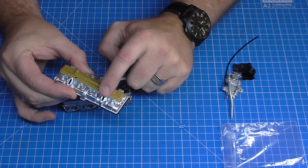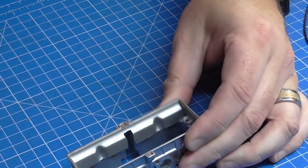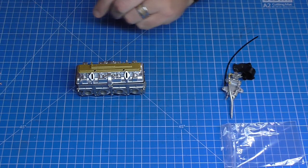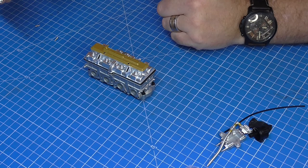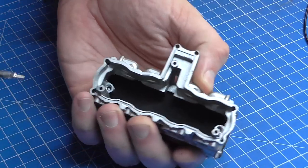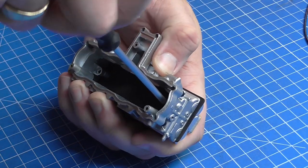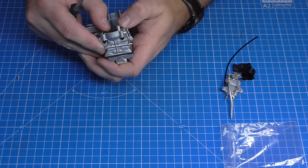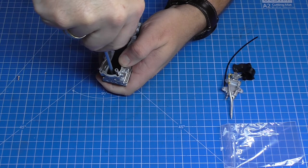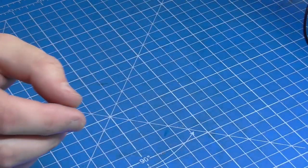We're piecing these two parts together — the slots on this side are going to face the opposite side of the cylinder section, going on just like that. I'm holding these in with type B screws from the last stage, going into metal, so I'm using my heavy-duty screwdriver from the underside. I put them in lightly at first while I line everything up, then make it as tight as possible. That's now one whole piece.